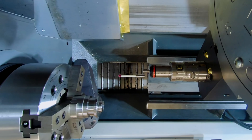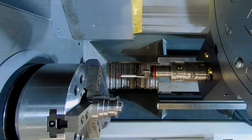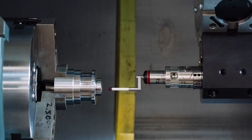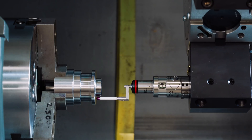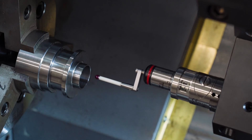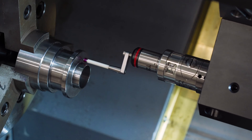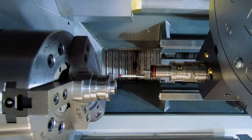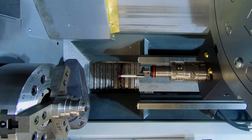Using a combination of these measuring routines allows you to ensure your part is properly loaded in the chuck before machining and that parts are staying in tolerance while being turned. This is almost a necessity for an automatic turning cell and can easily save time on manually loaded setups so your operator can tend to other machines. If your turning cell fits either of these cases, we think you should take a look at adding WIPS L to your lathe. Thanks for watching and we'll see you next time.